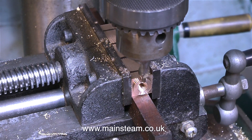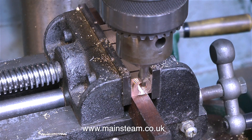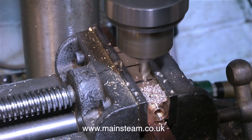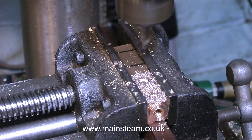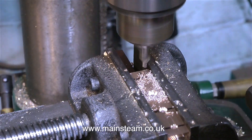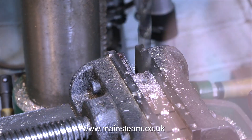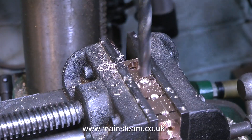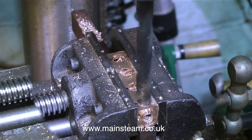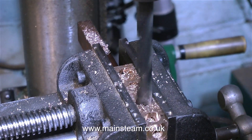I'm not using any kind of test apparatus to find the centre — I've moved the centre drill to the front of the work, which when I look down the end of this piece confirms it's in the right place, so I can just go ahead and drill the holes. My drilling machine, by the way, is terrible. I bought it a few years ago and I wish I hadn't. The good thing about it is the table goes up and down by winding a handle, and it is allegedly a British made machine — but it's diabolical. It's never been accurate, but I work around it. The motor starting capacitor doesn't work anymore, so I have to spin it by hand — I switch it on and just flick the chuck, which is really bad practice and a health and safety nightmare, but I get there in the end.